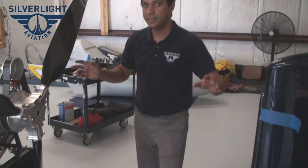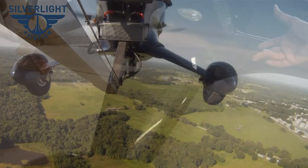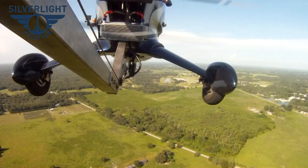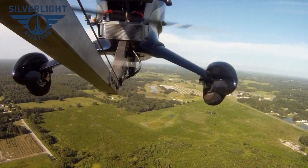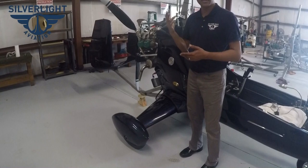The tail is completely newly designed. On the gyroplanes, the landing gear fairings have an airfoil shape. This airfoil shape actually starts producing some residual lift as the gyroplane goes faster, unloading the rotor at a certain speed. It can give up to 60-70 pounds of lift depending on speed. At lower speeds it doesn't do anything, but at faster speeds it starts producing residual lift, helping cut what the rotor disc has to do.